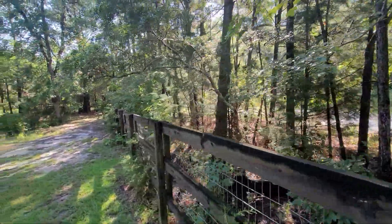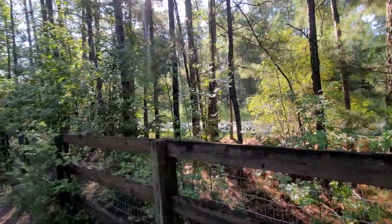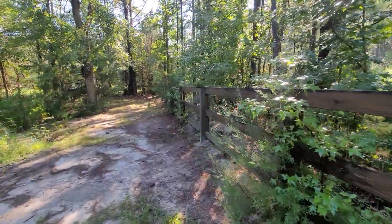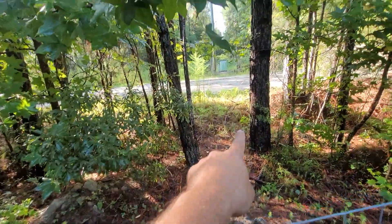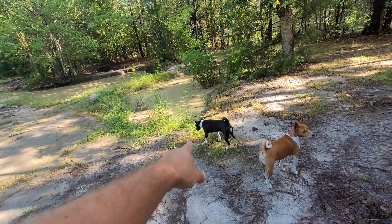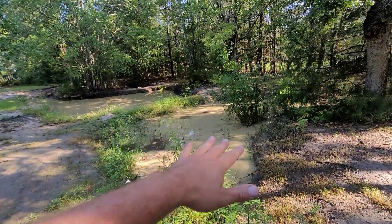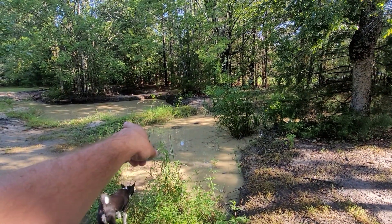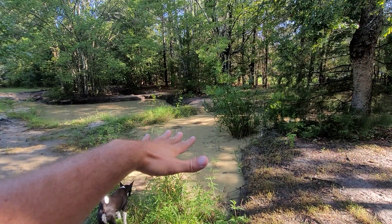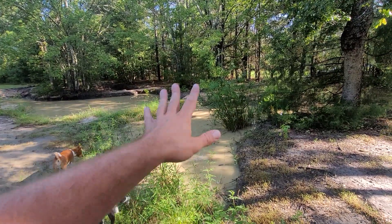The drainage ditch on the road — I initially had a flood down here on the roadway, so I put a culvert in that taps in and goes between these trees somehow miraculously. I dug a channel and laid 40 feet of culvert over to this bog. The bog is the first filter for the water, and it has a siphon trap that feeds into the pond, so all of the oil and sediment on top of the water won't pass through to the pond — it'll just soak into the surface sediment as it evaporates.